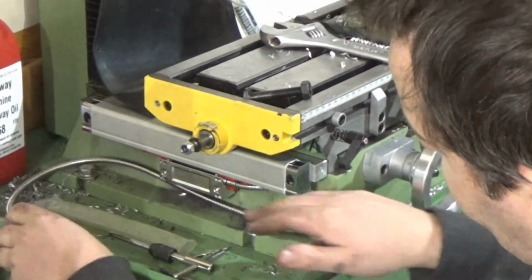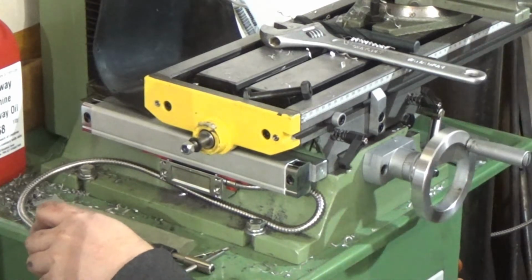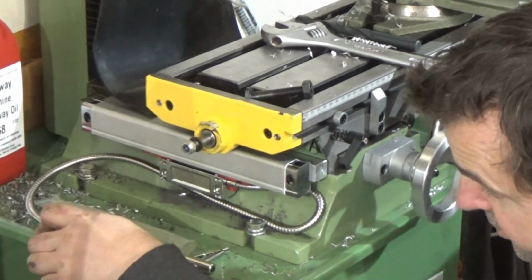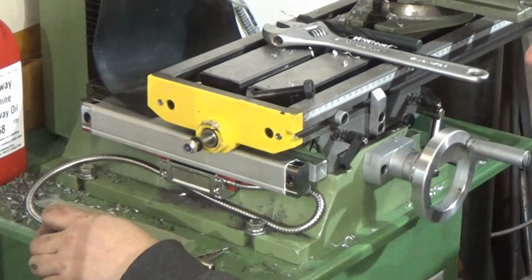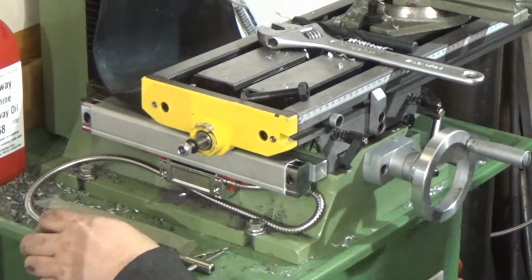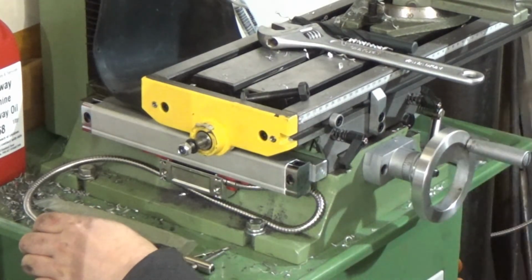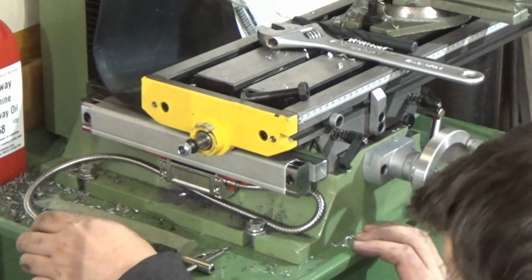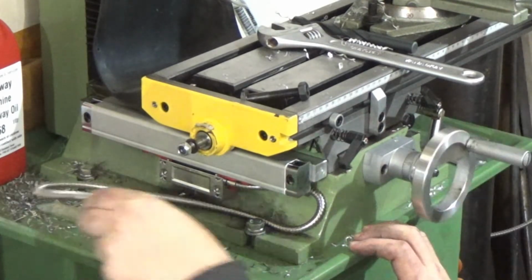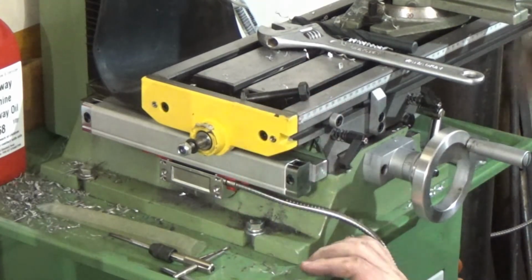Basically, I've just got to make an L bracket now to go onto that piece, and it's actually hitting probably about 1 millimetre. So if at any point I've got to take that end cap off, I can just mill the bottom of that radius off a couple of mil, and no chance of hitting that. So it's the next part. It's going to be the bracket. Let's crack on with that.